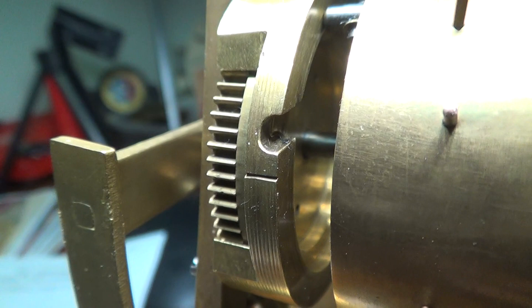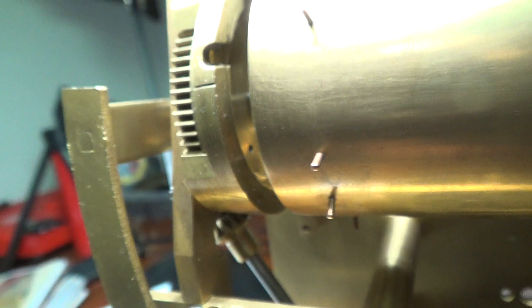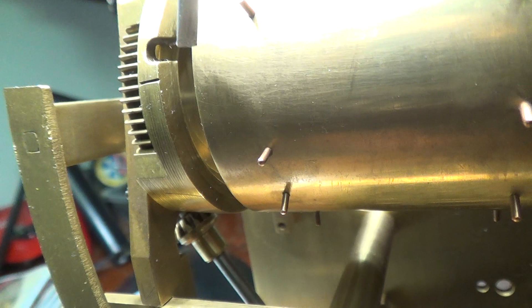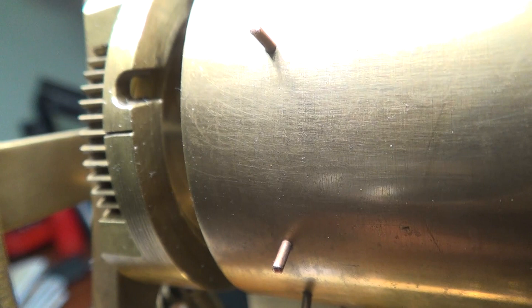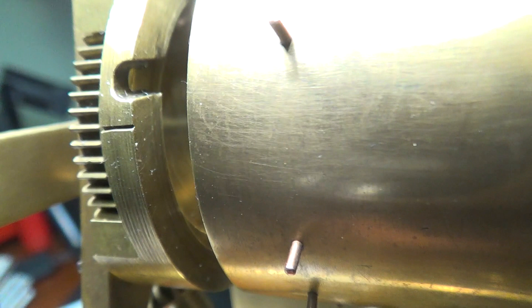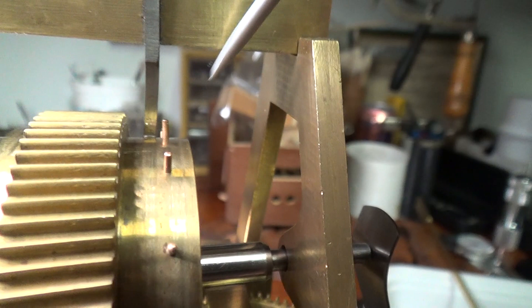Instead, this mechanism has three separate layers or heights. It has this outer rim on which the pin rides during the chime mechanism. Then it drops onto a surface — a second layer — that also allows the roller to be shifted to the left. That second layer has a movable slot controlled by a gear that moves forward with each progressing hour, and allows the roller to strike the proper number of hours by falling in a hole, dropping to a lower level, which then shifts the roller so that the hammer is on the outside of the pins. Pretty complicated little thing, very ingenious.